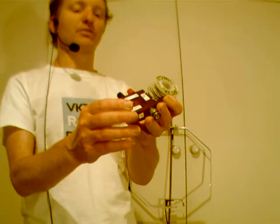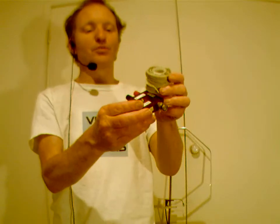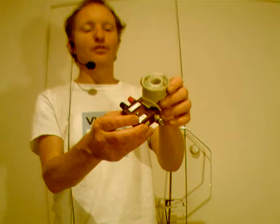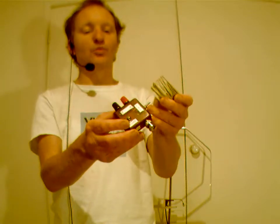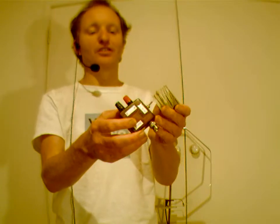You don't need a separate antenna analyzer. You don't need a separate VSWR meter. The one in your FT817 or similar will be good enough. But yeah, this is a very simple portable antenna. It'll get you going as a half wavelength on 40 meters. It'll be a full wavelength on 20 meters, but you can still tune it up. And you might be able to cover other bands like 30 and 17 meters with this coupler.